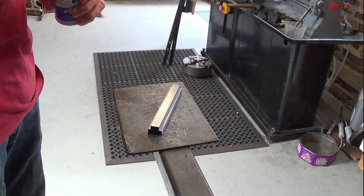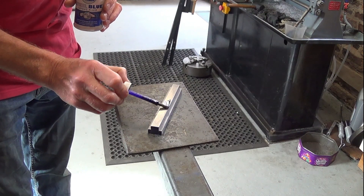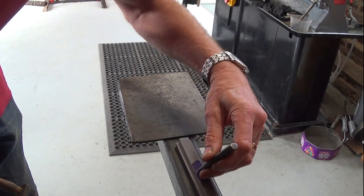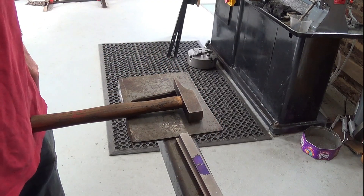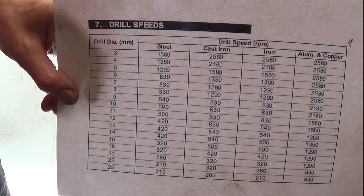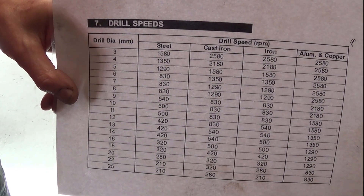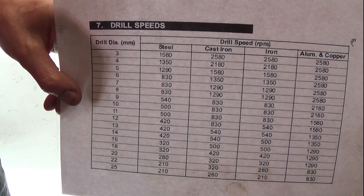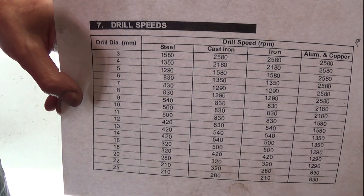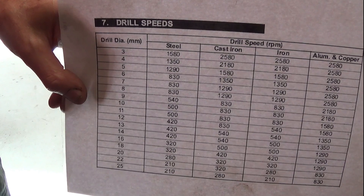It's made — let's see how we get on. Ta-da! Now I've made the basic long T-nut, I can turn to drilling and threading in the centre. I'll put a bit of blue on there and let that dry. Get the centre marked. Now over to the drill. I've looked at my drill speed chart — the tapping drill for a 10mm metric coarse thread is 8.5mm. The speeds for the drill are stepped because it operates on pulleys, and I'm going to go for 720 RPM.